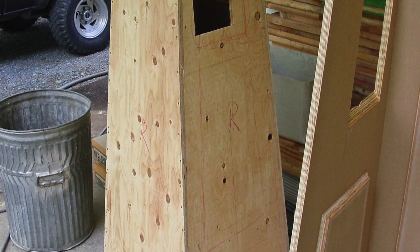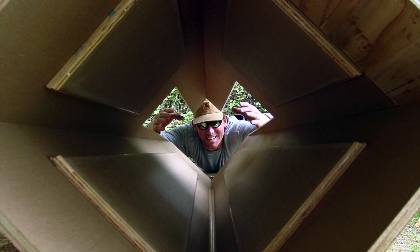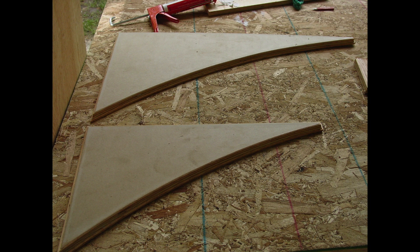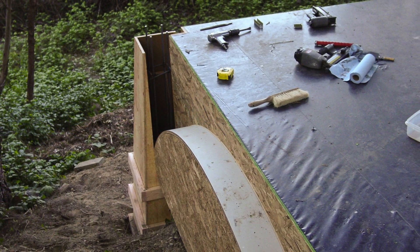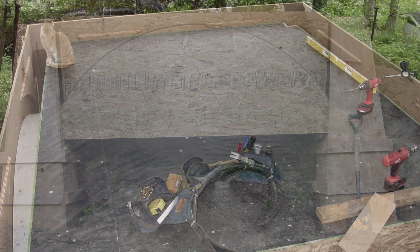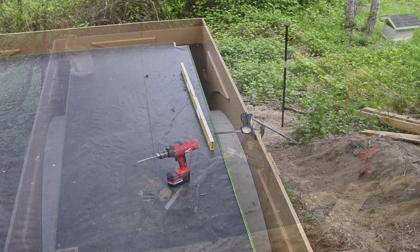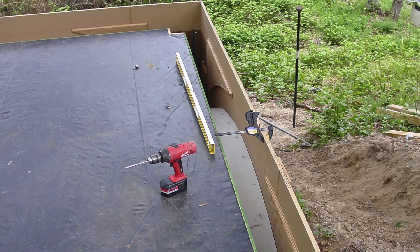You can see the panels are all attached to the insides of these corner posts. The edges were routed with an OG router bit, and I had to rub down the edge of every single panel with silicone to seal the raw wood side, because otherwise the concrete would stick — I learned this from the tests I did earlier. Here's the inside of a pillar with all the panels installed; it's basically like building cabinets in reverse. Now you can see the curved arched panels installed on the inside of the walls, and I had to reach down in there and seal every joint around every panel and every curve.